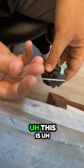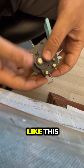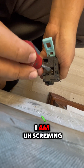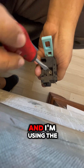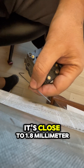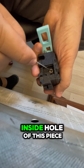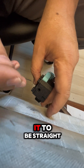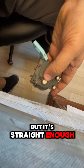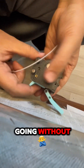I am using a 1.5mm allen wrench and I am putting it inside like this, and with a big flat screwdriver I am screwing this in. I'm using the allen wrench because it's the only thing close to 1.8mm — the maximum inside hole of this piece — to guide it to be straight. Even though this allen wrench is not perfectly straight, it's straight enough. And now the final test: inserting filament goes smoothly, without issue.